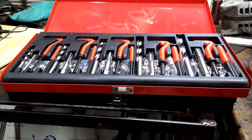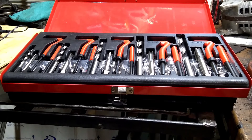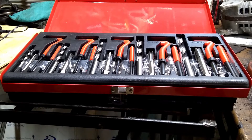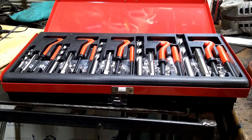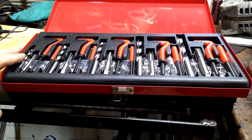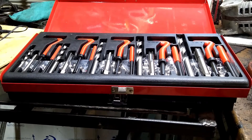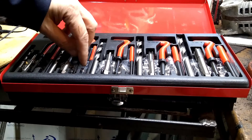If you do much work, especially with aluminum, you're going to find that threads get pulled fairly frequently, so you need a repair kit. There's a brand name called Helicoil — they're fairly expensive. This is a cheap version of that purchased off Amazon. Basically it's just a helical insert of threads.